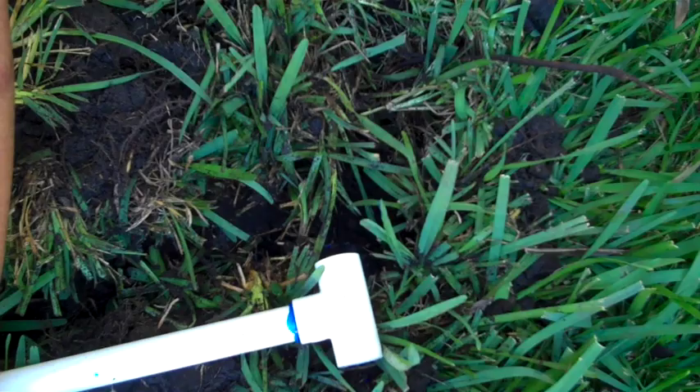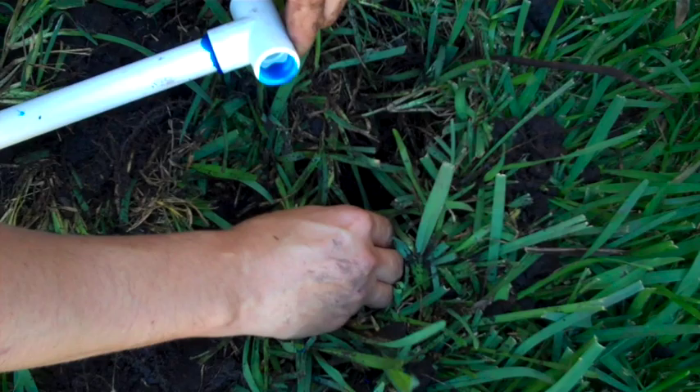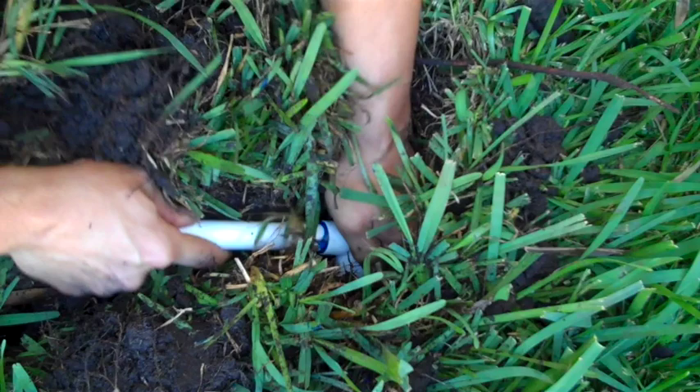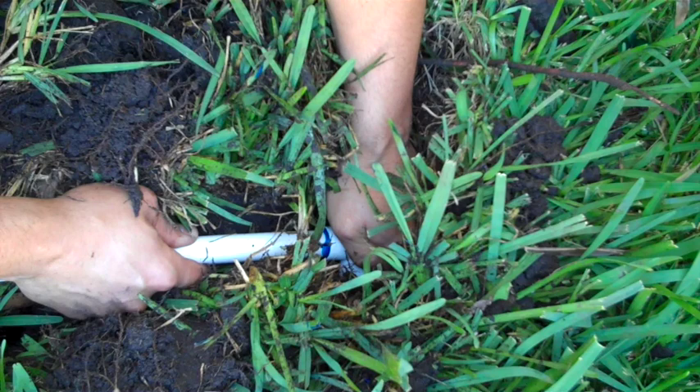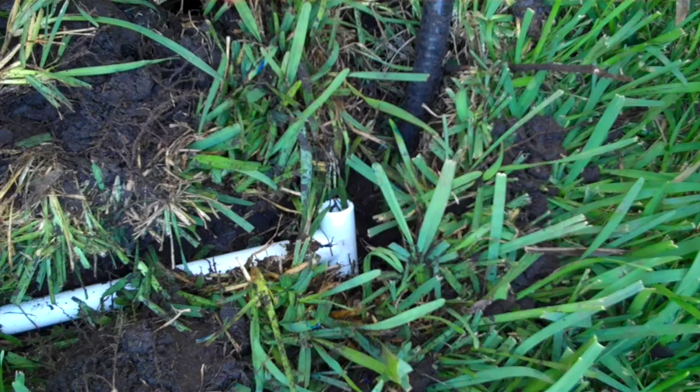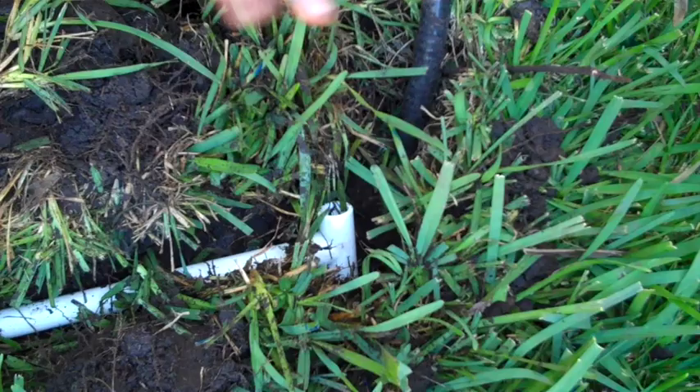Then the next step is do the same thing down here — wipe off as much dirt as you can, put a little bit on the inside of your joint and a little bit on the sleeve, try to get it on there as best you can. I know this may seem like I'm not doing the best job, but I've done this several times and never had any issue with the pipes coming undone. Push it on quickly, hold it in place, and let it set for a moment. Then do the same thing with the other side that you cut, and go ahead and bury everything back down in there. You may need a little extra dirt since you've relocated some.